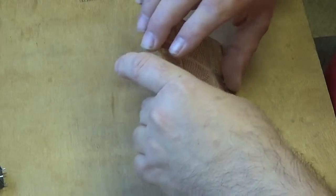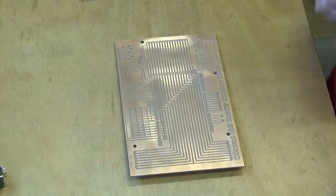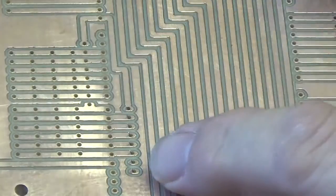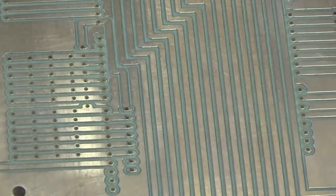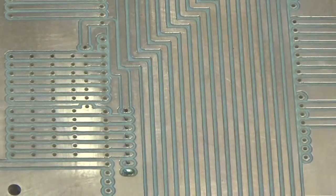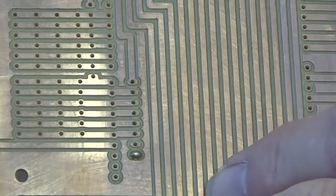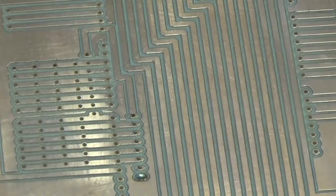The tricky part now is to actually turn the thing over without the resistor pack falling out. I've got one in there now. We have our pins coming through the holes, and the easiest way to go about this is to get some solder and just tack one of the pins to the board — it doesn't matter which one. That's now enough to hold it in so I've tacked one end with the other pins still to solder, and I'll go ahead and solder this first one in place.